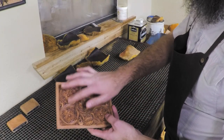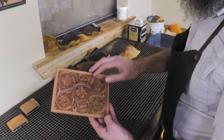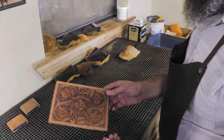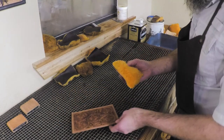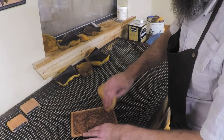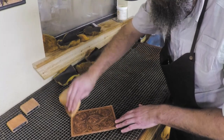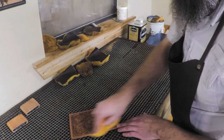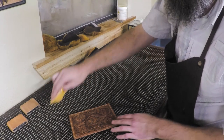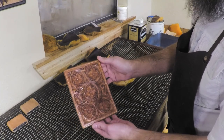It's been about 30-40 minutes and we've still got a little bit of a dark area in here. What we're gonna do is touch up these lighter areas in the pattern and try to bring them up to the darker areas to get it more balanced out. You don't need to go in with a lot of oil — it's better to go with just what's left in the pad. You can spot treat and just go where the lighter areas are without going back over what's already dark.